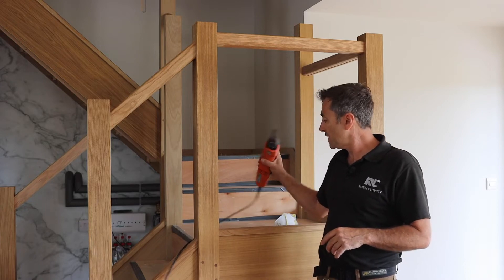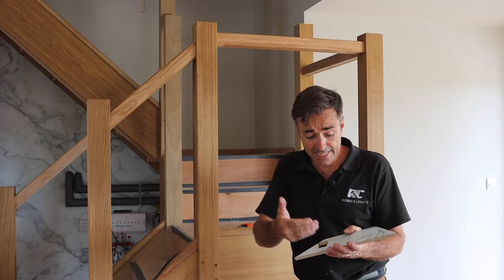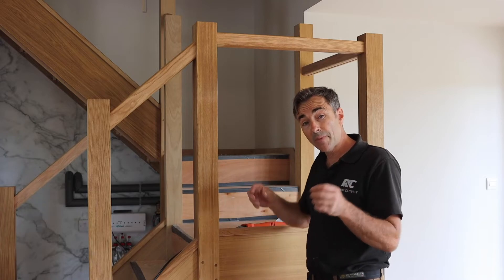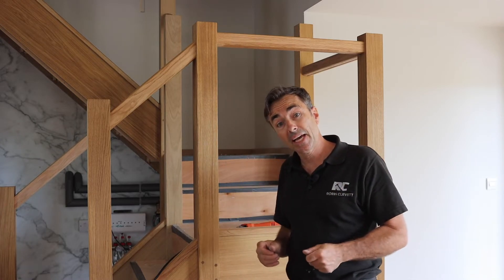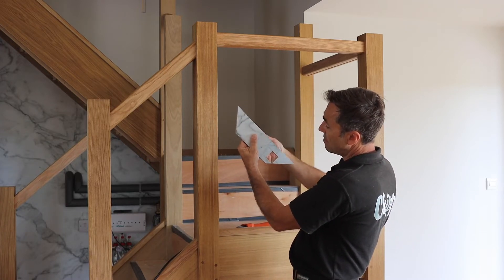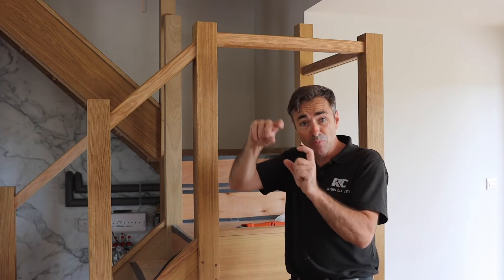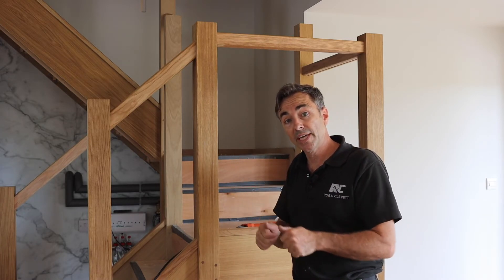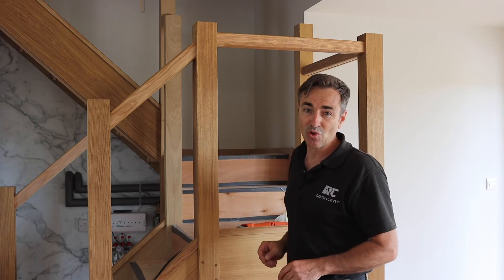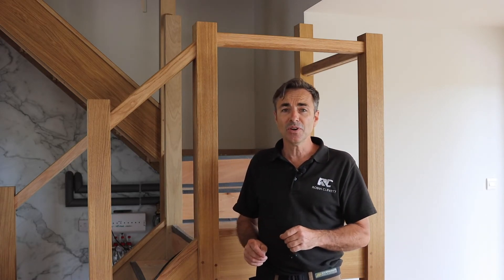Using a 32 millimeter rapid wood blade, I was able to form a very simple template — slightly tapered, square in section. We fitted that over the string, and also made a plug out of some oak that exactly fitted it. We cut through one side, cut back through into the oak the other side so it was tapered as well, then made the square mortise in the string and glued the block in. The last job is to cut it flush and sand it up once the glue is dried. Please check back soon on the 101 uses of a multi-tool on tour.